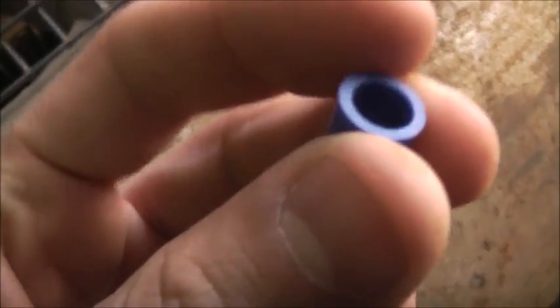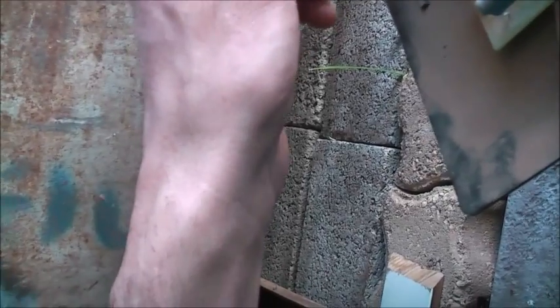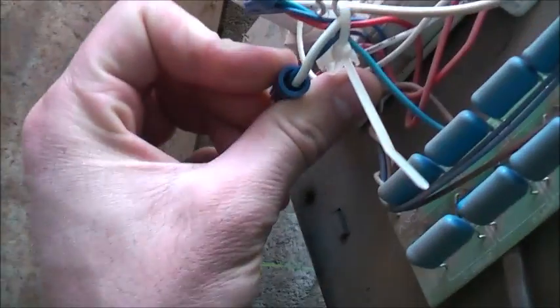So you see there's a spring in there. The spring looks kind of like a helicoil — that's how they work. It's like a helicoil in a conical tapered shape. And as you screw these on, they bite onto the wire and just pull them together. A tapered conical shaped spring bites in and pulls the wires into the center and bites them in that way. That's basically how they work.